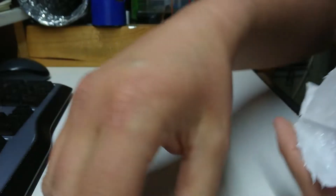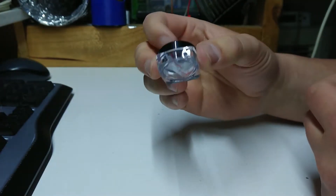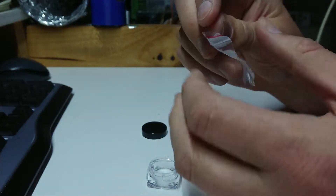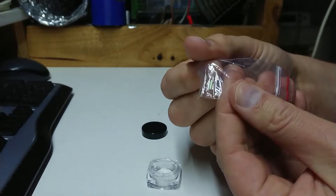I had a delivery arrive today — these are a little on the radioactive side. These are tritium gas tubes. They're tiny but I spent about 20 or 25 bucks each. There's a blue one and a green one. The gas inside is radioactive, and the inside of the glass tube is coated with a phosphor, similar to a fluorescent tube, so particles from the radioactive gas cause the phosphor to illuminate and fluoresce.